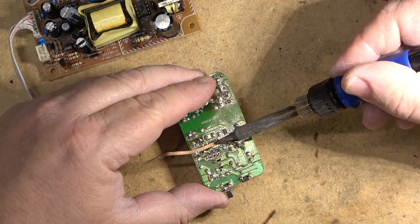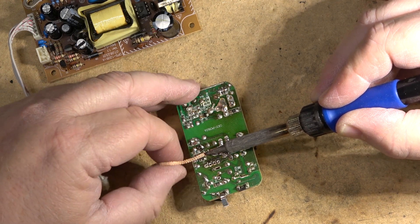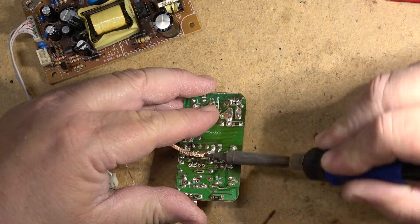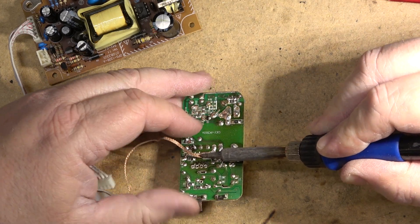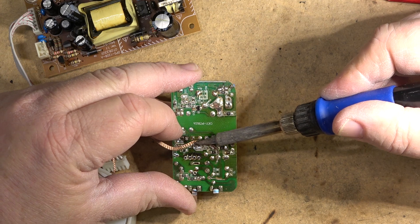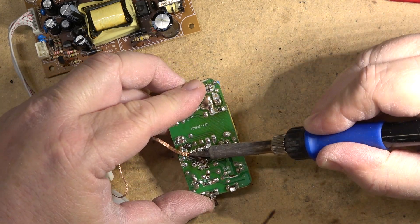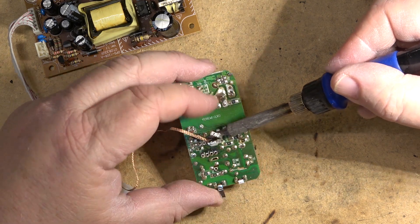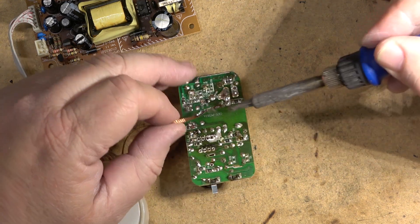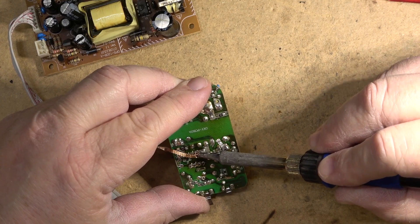These normally don't fail without a reason, and for a catastrophic failure like this, I'm going to say it's probably the input filter. There are two input filter capacitors on here — they're relatively small, around 22 microfarads 400 volt — that just does the filtering of the rectified AC. If the filters go open, you end up with a lot of ripple, and that ripple can cause the MOSFET to latch up and not switch on and off. It's normally switching at a high frequency; if it latches, it's going to blow something. In this case it blew a hole right in the top of the MOSFET.